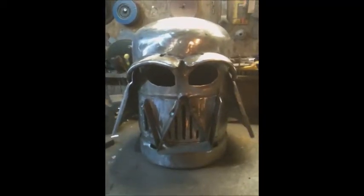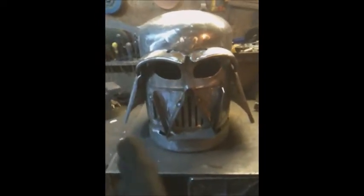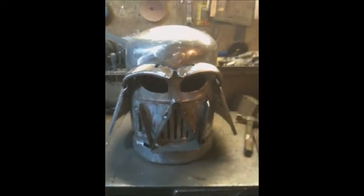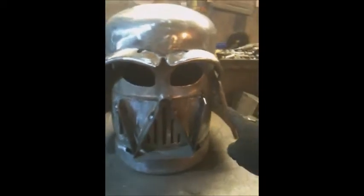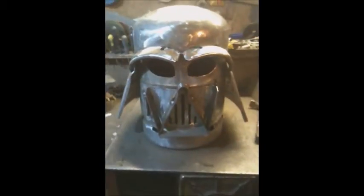So that kind of works. I'm giving it again, shove a piece of flat bar over, pass it over. I did have to grind that spot weld off a little bit too narrow, I think. That allowed me to pull it out a little bit. I think I still need to pull it out a little bit more, looking straight at that symmetrically. I can see more under here than I can under here, so that side needs upping out a bit, so I'll just do that now.